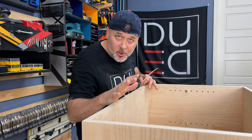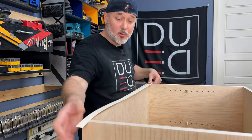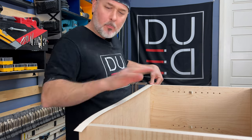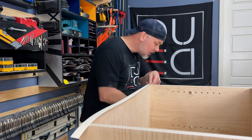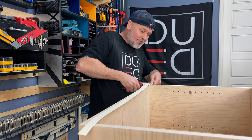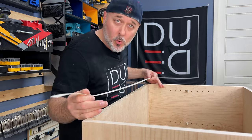The first thing you're going to do is cut your piece of edgebanding — not to the exact length. We're going to go plenty big so we have plenty of space. Just put it on top, give yourself about an inch or more on each side, snap it off, and now you have a piece that's plenty long to start working with. That's step one.